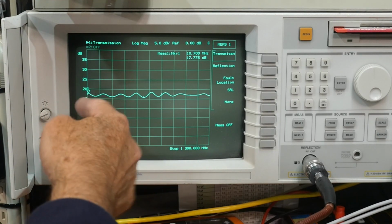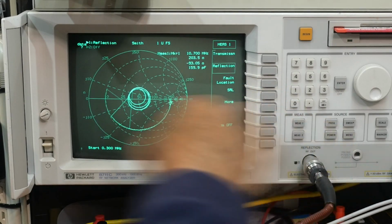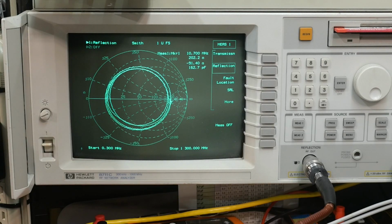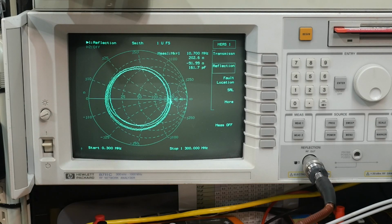All right, another way to prove that it's wavy because it's probably not 50 ohms is you can take a look at the input S11 parameter, and it's certainly not 50 ohms. It's up there around 200 ohms, okay? So we've got a 200 ohm input impedance. Well, that's not right. So it could be that once again they used a PC board that was too thick for the traces. I don't know, but it's only a 200 ohm impedance, not 50 ohms. So there's something odd going on, and we're not getting the gain that we need either.